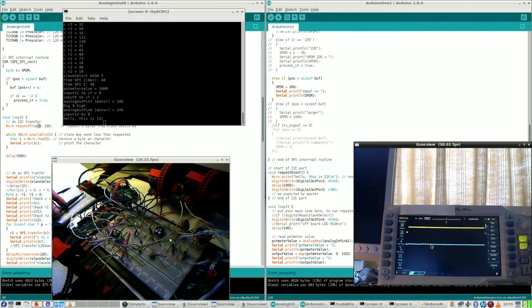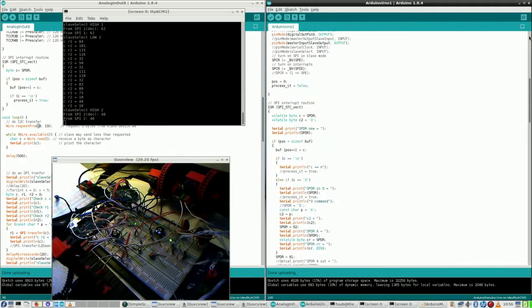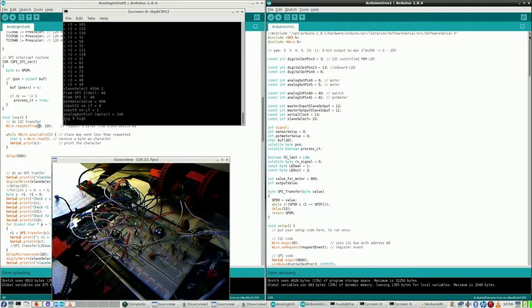So when I change the time base, it's quiet. Absolutely quiet. That's not good. So what is wrong here? Let's check the code. Digital out pin 3. Digital with a small d, out, pin with a capital P.